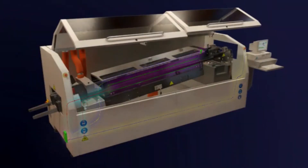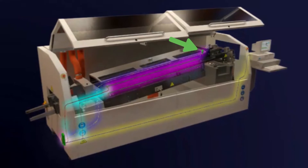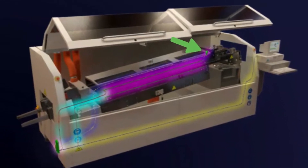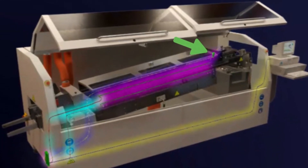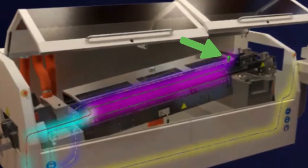In addition to monitoring temperatures in the preheat area, the WPI system hardware also uses a thermocouple in the solder pot. The WPI system continuously measures the solder pot temperature to ensure proper operating temperatures and indirectly monitor solder pot levels.